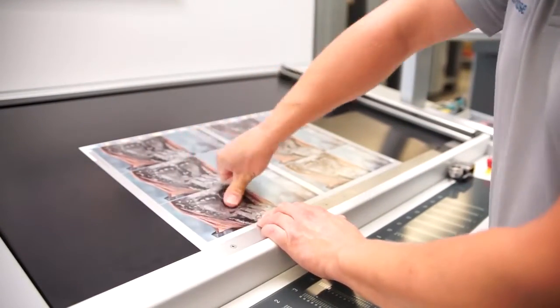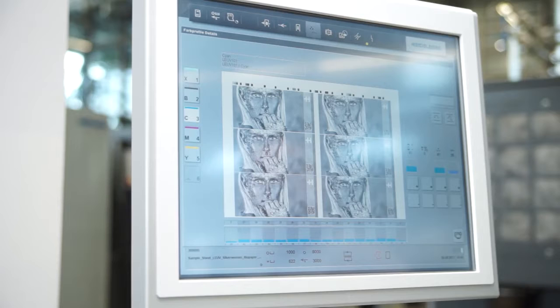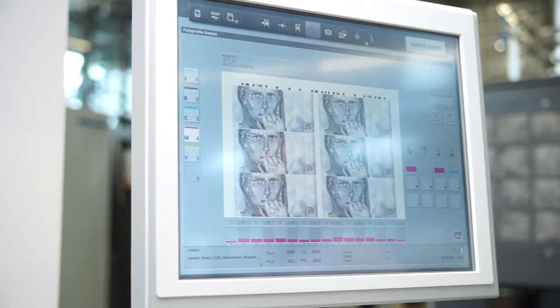For this job we use this metallized paper for this special shiny effect. All inks will appear differently on this paper, but as we still need the ink control measurement, we put an opaque white right behind the ink control strip. The four colors are applied in the well-known and common way.